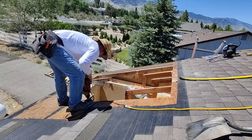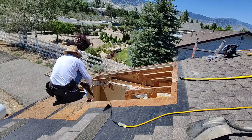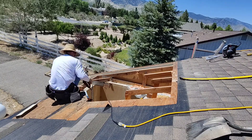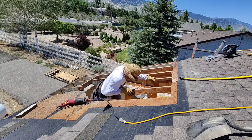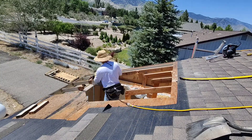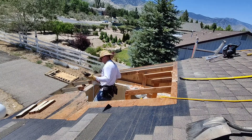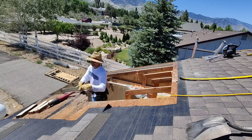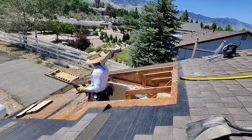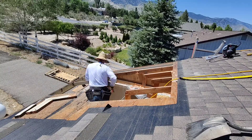They also had little stubby pieces at the ends of the trusses that created pretty much the rafter tails, but I removed those too. I wanted to replace them with complete pieces all the way out to the fascia board where the gutter is supported. I wanted to make it as solid as I can. A Sawzall is a really cool tool for that kind of work — it goes quick and cuts through nails.